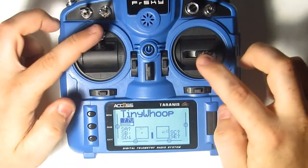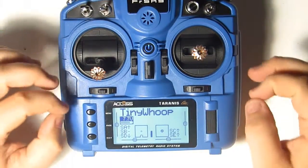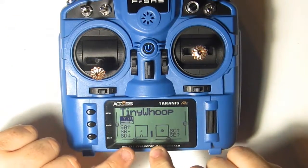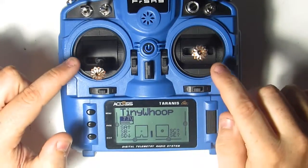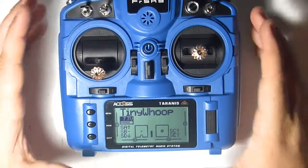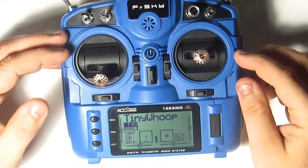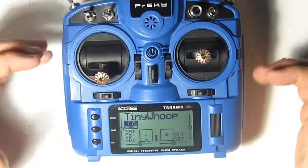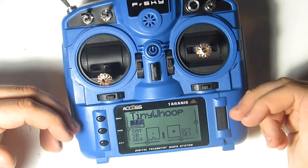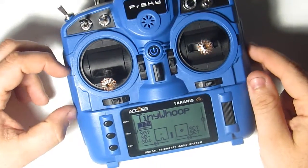And that's it — it's that easy. See how they're perfectly centered now. The big issue with stick calibration is making sure you allow the sticks to be at their natural center, not the screen. Hope this video helps and alleviates some confusion that seems to affect over fifty percent of the FPV community when calibrating their controllers. I'd always recommend doing a stick calibration whenever you get a new radio, because nine times out of ten they're slightly off even if considered calibrated from the factory.